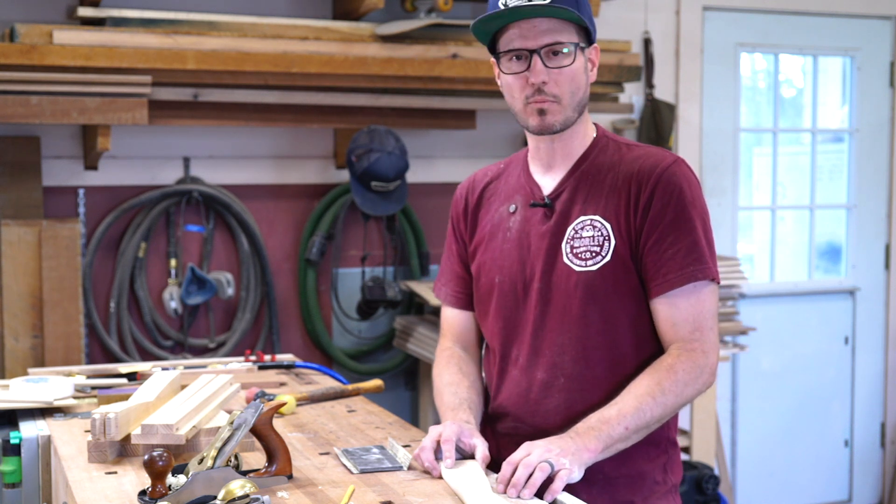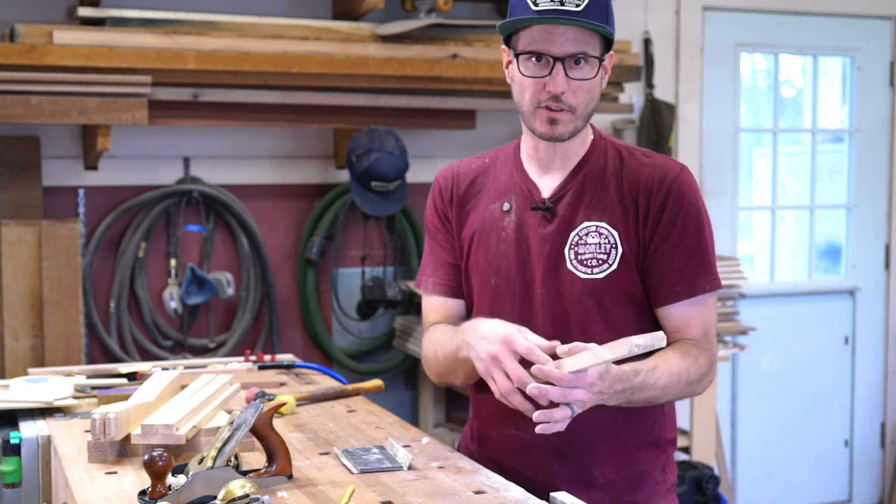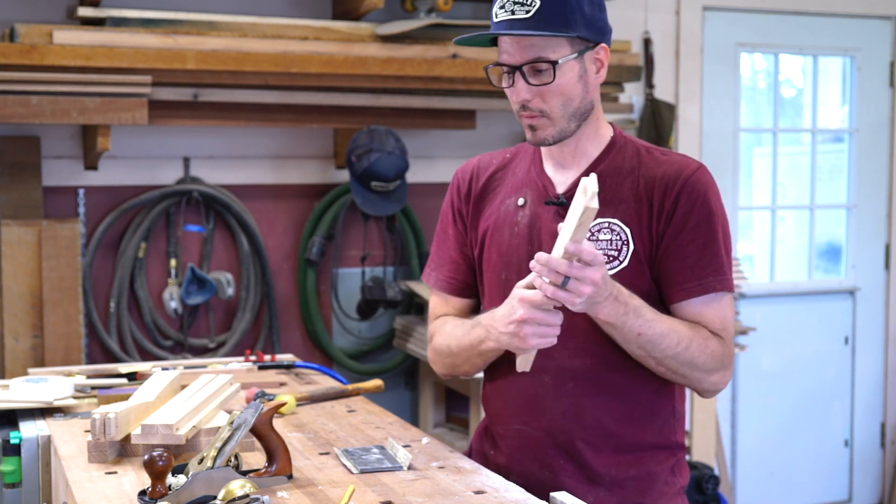So the progression is probably 100, 120, 180, 240, 320 — and then you're done. Depending on what finish you're using, you may need to go higher for an oil. So that's that one. I'll show the edge profile on the curved edge next.